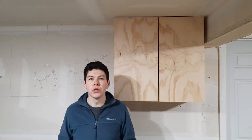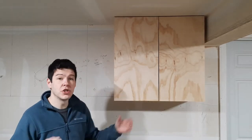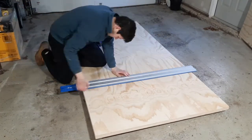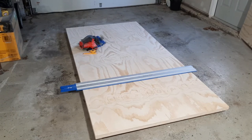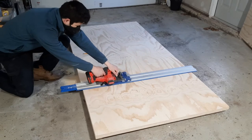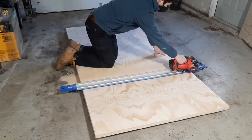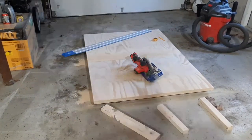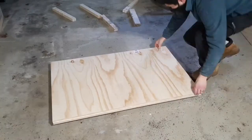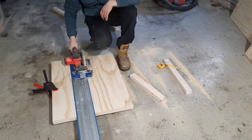This is part of our garage storage solution, so let's go back a few days when all I had was a sheet of plywood. The first thing to do is make a little sketch of where you're going to cut each piece from on each bit of plywood. I've got two pieces of plywood here because I'm making multiple cabinets of the same size. My first cut is 30 inches long — that's the side and top of this cabinet. I'm making my cabinets 12 inches deep, which makes it really easy when cutting across a 4-foot by 8-foot piece of plywood.